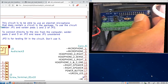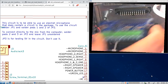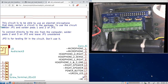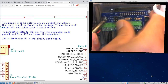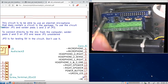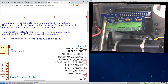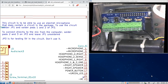Oh, wow. Well, maybe I didn't need to do that in this case. I guess I must have fixed it in the BOM, because this is the right length. Well, since we're here, let's do this. Put it in place, and I'll screw it in. Or not. Okay. No, it is. We did need to do this, because once you screw it in place, the post is long enough that it pulls the circuit board away from the connector. So this was a necessary step.